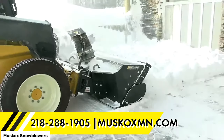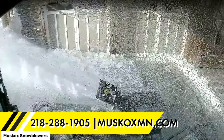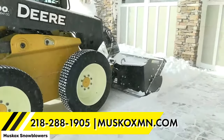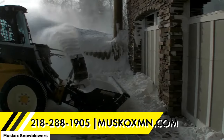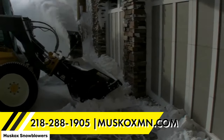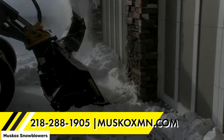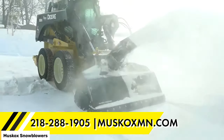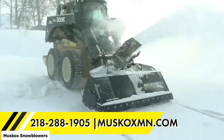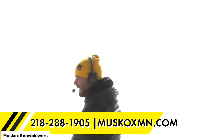Now I'm going to show you the back drag mode. You can see I keep the blower down as I'm moving forward, and when I get close to a wall or door, I start rotating the chute slightly back and then lifting. I can see the front cut edge — I lower it right by the building, rotating down until it contacts the front edge and back dragging. Watch as Ron gets to the end, stops the machine slightly, lets the remaining snow blow out, lifts it up, and we pull very little snow back with us.